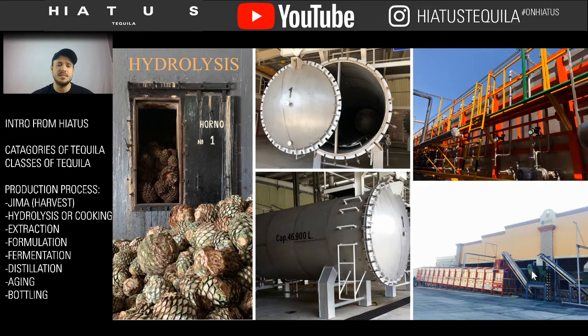The autoclave has hot water jets that pump steam in from the side and really, really cook the agave and extract as much sugar as possible. The only issue with this is that because you're cutting the agave so much and pumping it full of so much water, at the very end of the cycle you're going to have a very, very thin mosto. The mosto is the juice of the agave that's been extracted. This sugary juice is called mosto, and it's going to be very thin because you have so much water with the sugar.